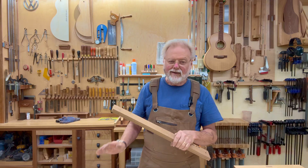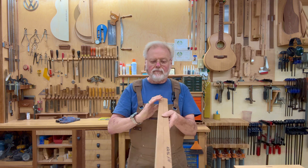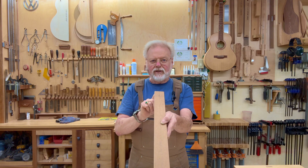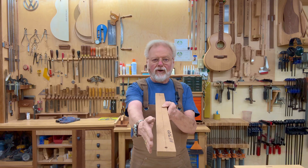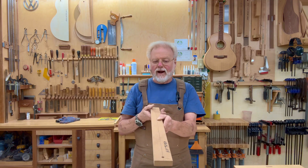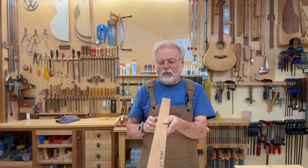I'm going to do a video on that, but I want to preface this by saying that we're not going to deal with angles at all, because it's so easy to make a mistake by trying to use an angle from that zero end of a fingerboard. If you make even a tenth of a degree error, it will make so much difference in the width further down the board that angles don't seem to be very practical and not necessarily accurate. Taper over its length is what we really want to work with.